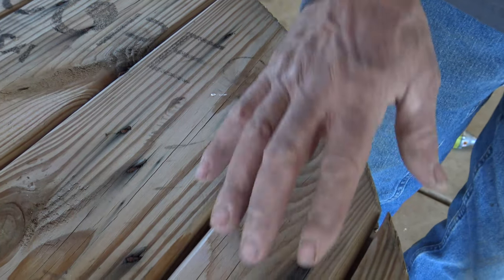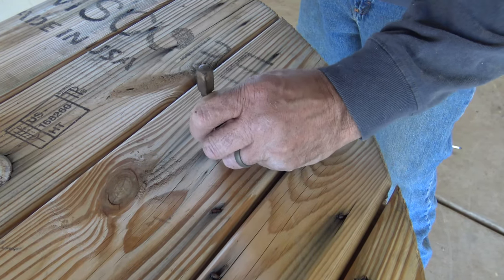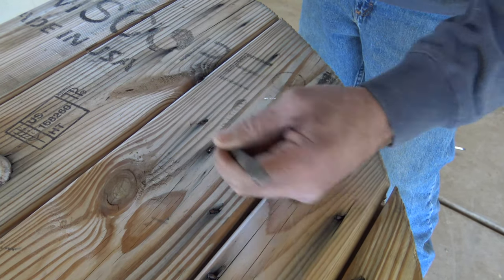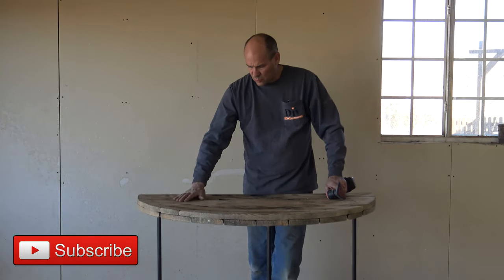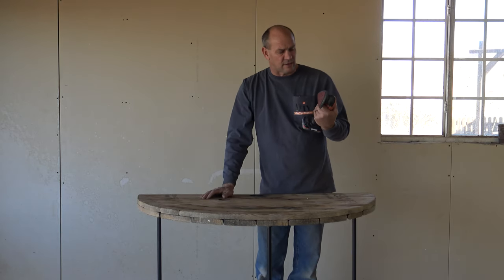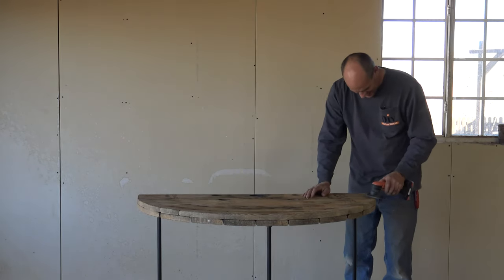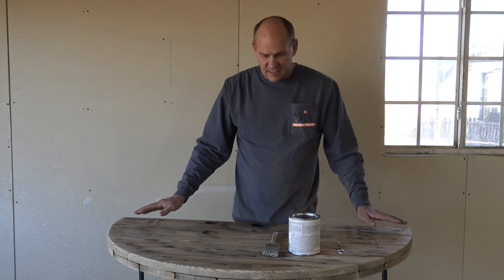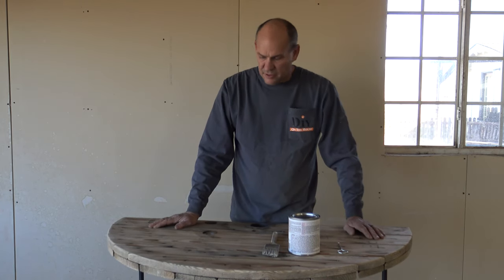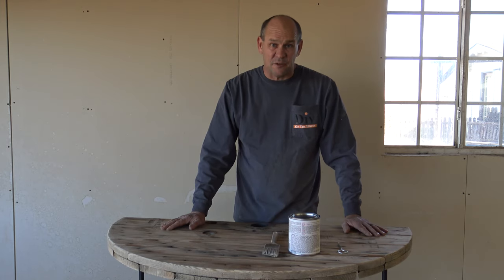Some of the nails from the construction of the cable reel are poking out, so I'm going to go around with my nail set and knock those in a bit. I've got all the nails knocked down so the surface is fairly smooth. Then we'll take a small sander — maybe an orbital one as well — and I'm just going to have a real good time sanding that. Everything's sanded now, and if I run my hand along the edges I'm not picking up any splinters, which is the main thing on these since they can be pretty rough. Next step is to put some varathane on, let it dry, and that'll be it.